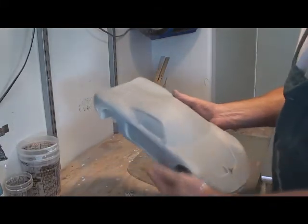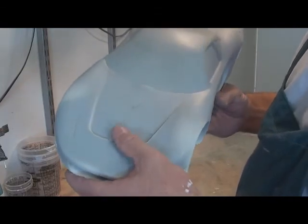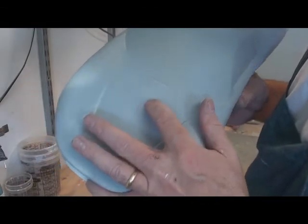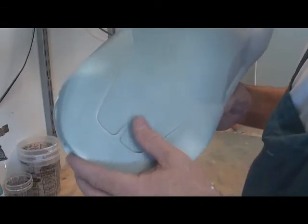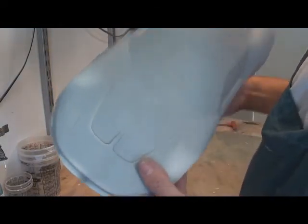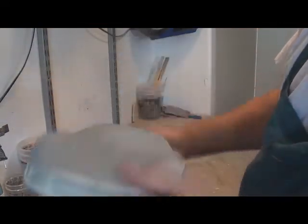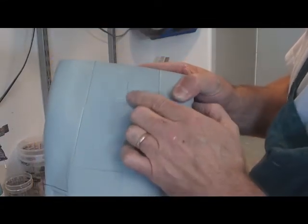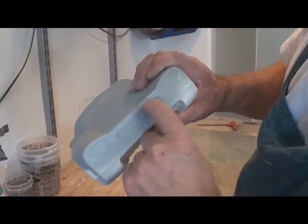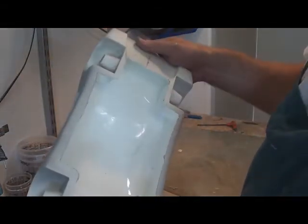Okay, the areas you're going to have to work on — this is how it just came straight out of the mold. You're going to have these seams right here that will have to be filled. This one came out pretty smooth, but I wouldn't try to do too much work on it. I'll probably just do another little video on showing what I do to get them ready to paint. Basically, I smooth down this seam right there, the seam underneath in here, and then there's a seam right back here where the actual mold split. I didn't get the seam here really clean — that's going to have to be addressed. But other than that we came up with a really good part.